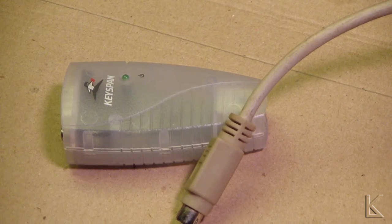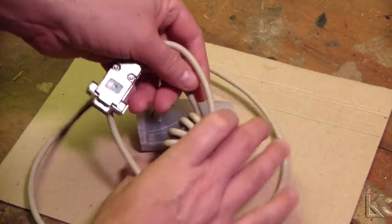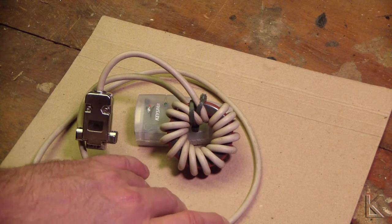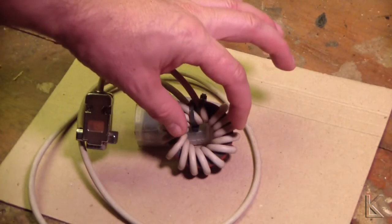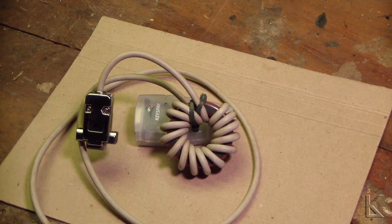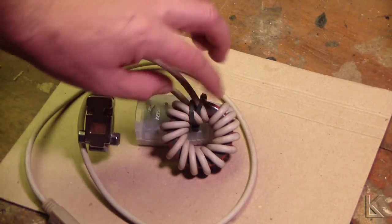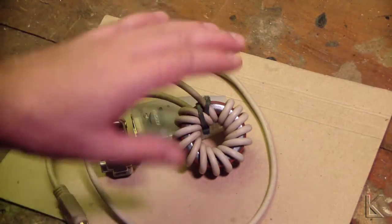Let me back the camera out and I'll show you. So this is my PS2 cable that comes from the Keyspan — looky there, you see I got this toroid core. I'll look it up and link to it in the video and down in the description below where you can buy these. It's a larger toroid core, two inches — big enough to thread the PS2 end through. I wrapped as many turns as I could squeeze in there, nice and even all the way around, locked down with a couple of zip ties. There's the 9-pin end, there's the end that goes to the radio.